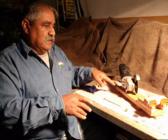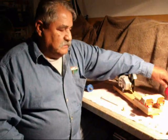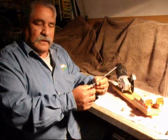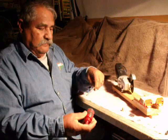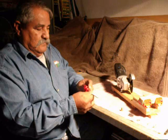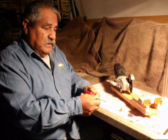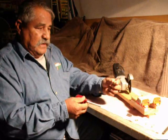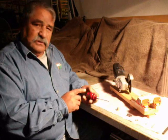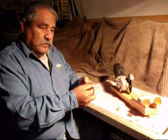I'm going to put this together and show you how it goes — show you how simple it is. You take a piece of all-thread and lock the nuts together on the end. You run it through your bit. Of course you can have adapters for different size holders, but the majority of these have a quarter-inch drill bit that runs in here, so you can use quarter-inch all-thread.